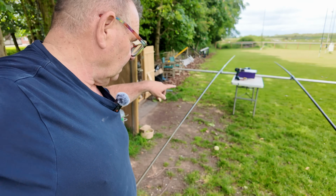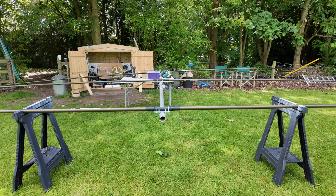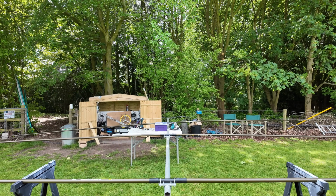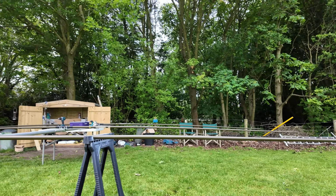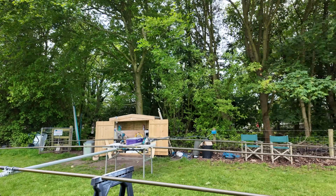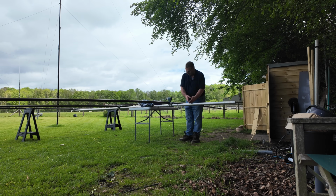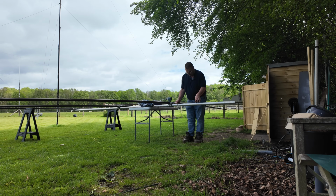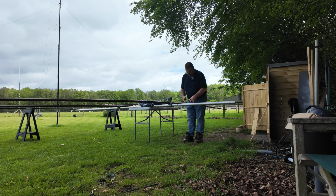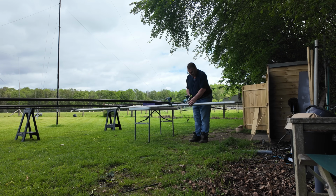It's looking big here. I just need to balance that final element, you know, tighten it up. So it's definitely left hand down at the moment. Yeah, that'll do. Right, now I need a little bit of length here because the 4 element 6 metre beam comes out, I seem to remember, about 30 centimetres. So I'll give myself 40, give it to there. Maybe a little bit more.